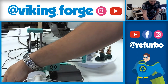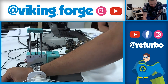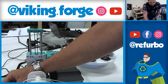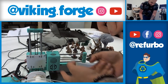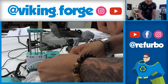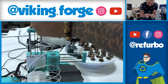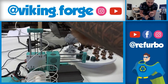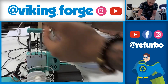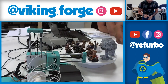On the printer, you just preheat for the filament. You have an option: preheat filament in or out. Select filament in — the nozzle will start to heat until it reaches about 200 degrees, and when it reaches 200 degrees the filament will start to load. Just make sure the tip of your filament is straight to avoid clogs and blocks when loading. Insert the filament on the top and wait for the extruder to heat.